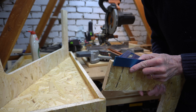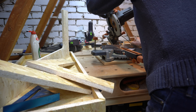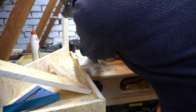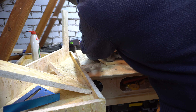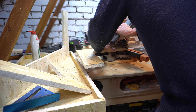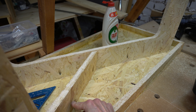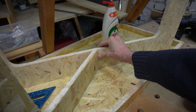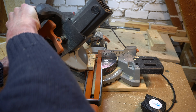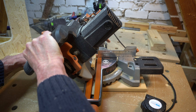I speak from experience — when I made my first pair of saw horses as an apprentice joiner. With the track saw you can't fully get into the corners because the radius of the blade would slightly over-cut the mark, so I had to complete the cut with my pull saw. I'm using a wedge to keep the kerf open and not bind with the saw. Once the offcut had been removed it was just a case of tidying up the corners.